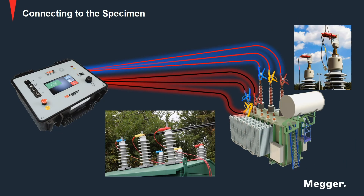Now let's discuss connecting to a test specimen. When testing high voltage transformers, caution must be used at all times and all safety precautions should be followed. Ensure that the leads of the TTRU3 using the Kelvin clamps are making direct contact with the metal on the test specimen. For example, if you are using transformer bushings, make sure that the Kelvin clamps are contacting the metal spades or metal terminals of the bushings.